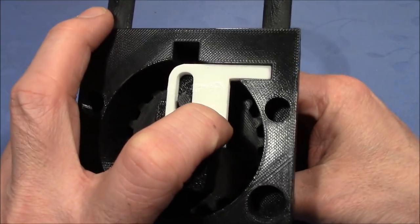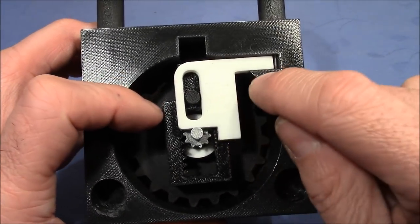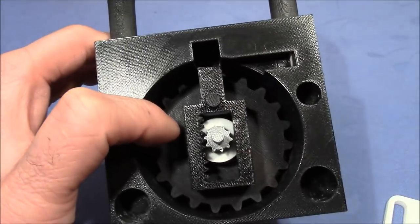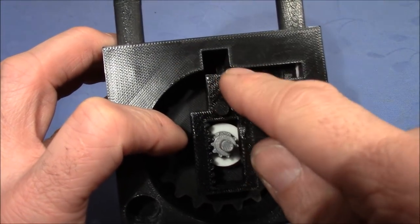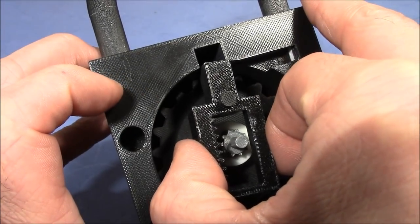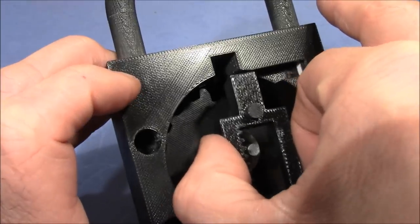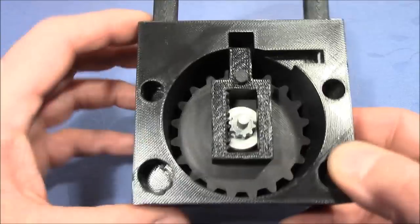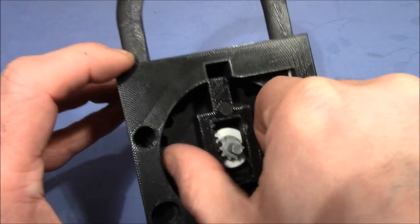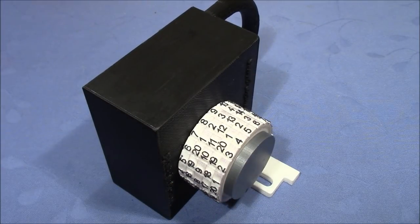Unlocked, unlocked, and overturned. I think if the tolerances here were made a little bit tighter, and also the bar a little bit longer, and also the edges of the bar on the actuator and on this cutout were rounded, it would be much smoother for the bar to enter this gap — even if it was tilted a little bit. This is easily possible with some small changes: making the tolerances tighter on this piece and making the edges round on the cutout and on the actuator. All right, so now this is really it. I will pack this lock and send it back. Thanks for watching, happy picking and decoding — cheers and bye bye.